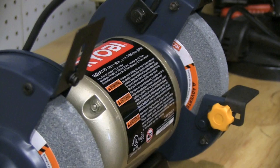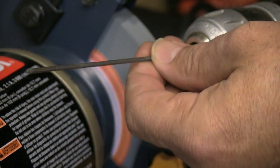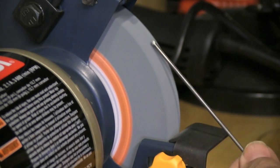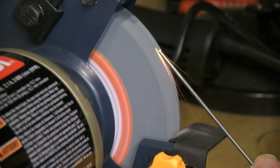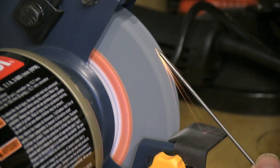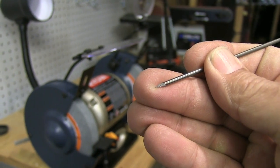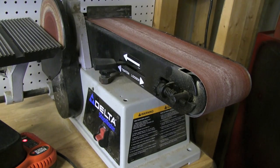I picked this up at Home Depot on sale for $30 — a six-inch bench grinder. For most people, unless you're working in the nuclear industry, semiconductor industry, pharmaceutical, or critical piping, for most jobs this will be just fine. There is a risk of embedding aluminum oxide on the tip, but this method has been used for so many years using aluminum oxide wheels, and lots of good welds have been made this way.